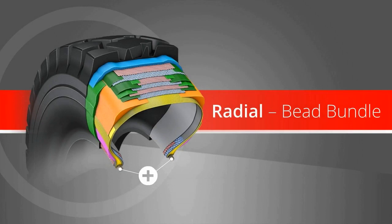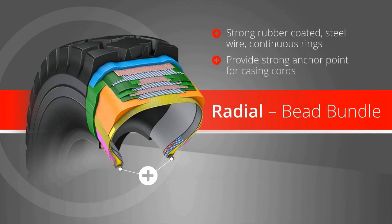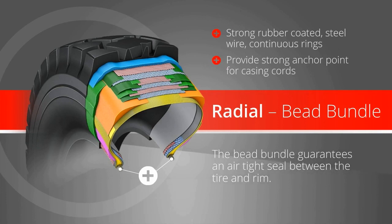Radial bead bundle. Bridgestone coils strong rubber-coated steel wire into continuous rings that provide a strong anchor point for the casing cords. The bead bundle guarantees an airtight seal between the tire and rim. Radial tires have only one bead bundle per side.